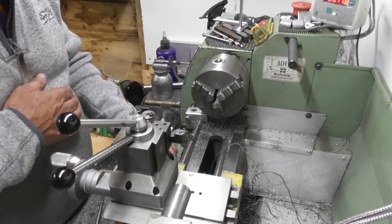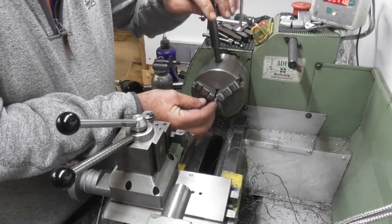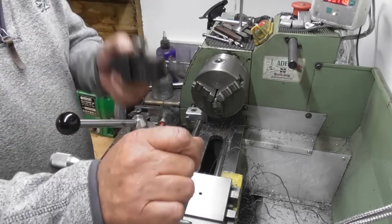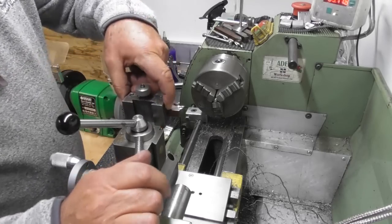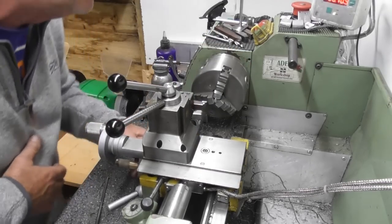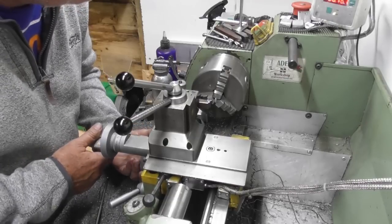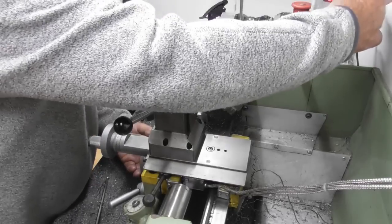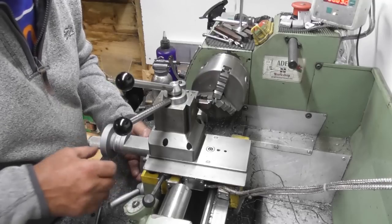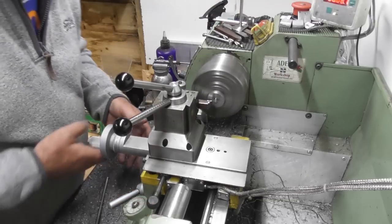So yeah, it's still a bit warm. So there's the little pin. Don't go crazy tightening the chuck up. What's it got to be, a 1/16 thick? Is that sat back in the chuck? It is a little. Again, it's not critical, this. If I touch my tip against the chuck, set that as zero. 1/16 is 62 and a half thou. In fact, I can just face it till I get to a 62 and a half reading.